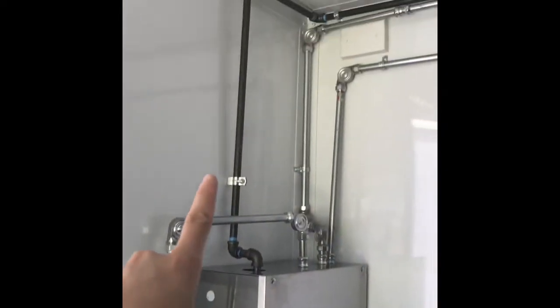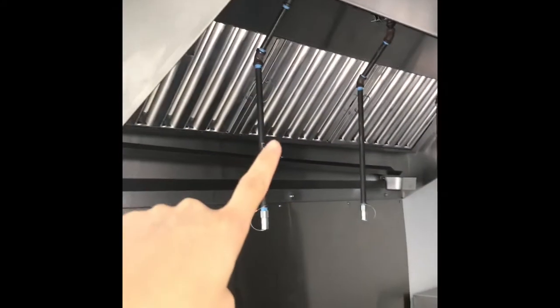I also have a deep fryer. Here is my preparation table — it's kind of dirty right now because I just got the fire suppression installed. That is a requirement from the city of Knoxville, where I live. Here are the three-head sprinklers that will spread out the foam — because I use a stove, they have to use chemicals to stop the fire, since water cannot stop a grease fire. Here is my hood. Before you purchase a food trailer, make sure you know about the fire suppression system, because I spent a lot more money doing this later on.